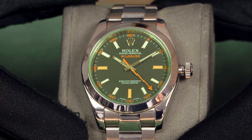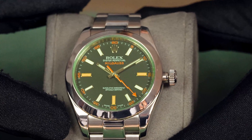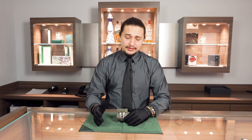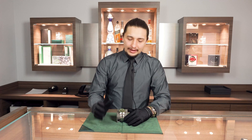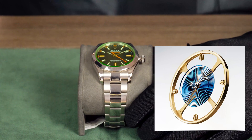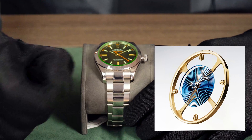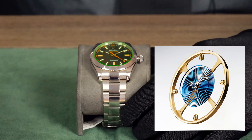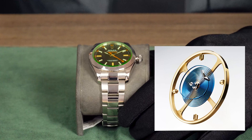So you might ask, what do I need an anti-magnetic watch for? Well, magnetism will actually completely jack up your watch. If you were to wear your watch into an MRI machine, around super computers, magnets, or anything like that, it'll totally mess up your watch. What happens is your hairspring inside your balance wheel will actually stick to itself, which will end up totally throwing off the timing — either making it run a bunch of seconds slow, or possibly sticking to a different point making you run a ton of seconds fast.